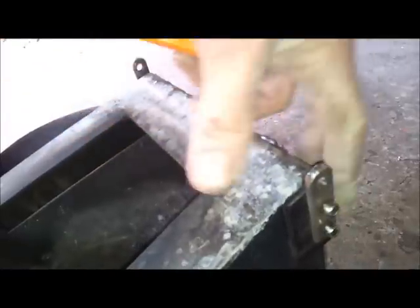The firebox is just a couple of flaps on the side, with pre-warming air entries and a hole in the back. There's another door on that side. I mounted the door glass with a couple of little studs on the back of the door - welded on one side, two screws on the other so I could take the door on and off. When I rebuild this firebox in the summer I'm just going to cut the top off and make a new one out of stainless.